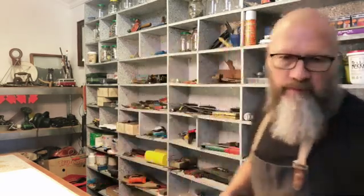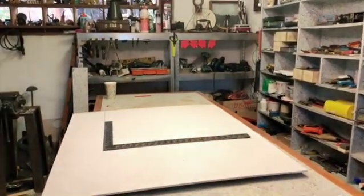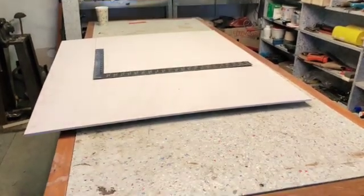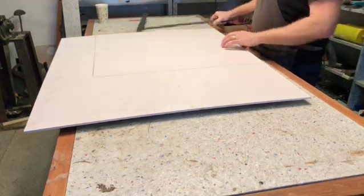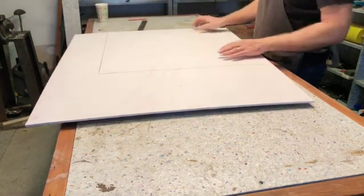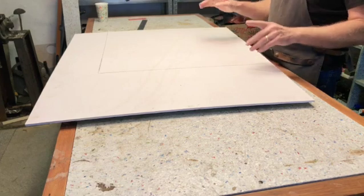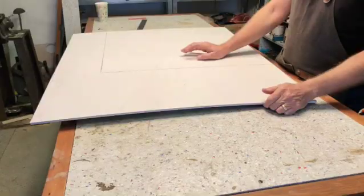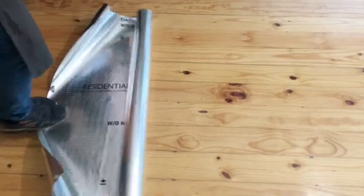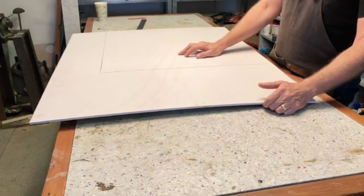What I have here is a piece of PVC that I'm going to cut to create a new lid for that hole, and then I'm going to make some holes in it and build a system that can be open or closed. For the construction I'm just going to use brandering that I have and create a framework inside the roof that I'll cover with some insulation material — the silver aluminium type. Let's do this.